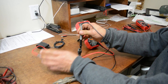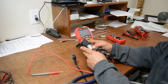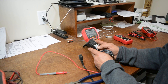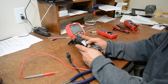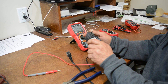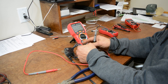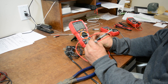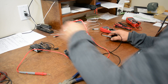Suppose you have a little transformer — you plug it in and the output is 12 volts DC at 100 milliamps. It's not very strong and you can short it out because of the low milliamp rating. If you wanted to check something like that, set your selector to DC, put your connections on, and go in to get a reading. Obviously it needs to be plugged in to get a live reading.